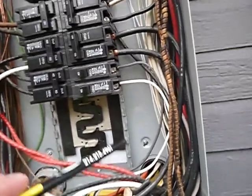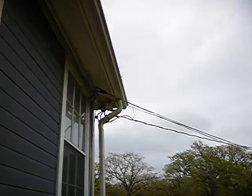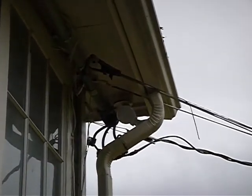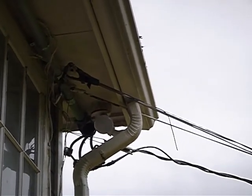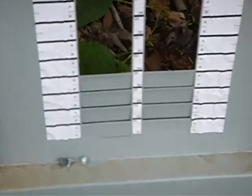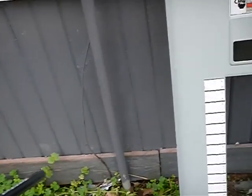The bonding location is not labeled. The electric conduit supply weatherhead over there is supposed to extend over the roof covering. There is no labeling on this panel at all — it's a recent installation. I'm not seeing a green tag either. If an electrical company came in, they should have pulled a permit — that would have been the prudent thing to do.